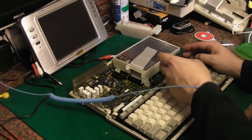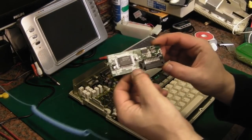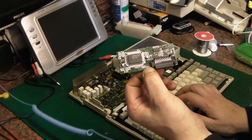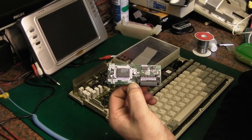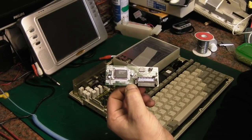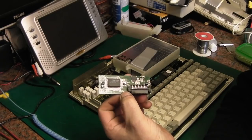I think we need to take the disk drive out so we don't damage it. As far as I'm aware, this is basically a RAM expansion. These things come from the factory with half a meg of RAM, but this one has got one meg. You can't really use one meg on an XT class computer, so it uses 640K for your actual memory and the rest as a RAM disk — a battery-backed-up RAM disk. So it has like a tiny little solid state hard drive. Obviously if the battery fails you lose your data, but it's another cool little feature. Like the fact it's got DOS in ROM.